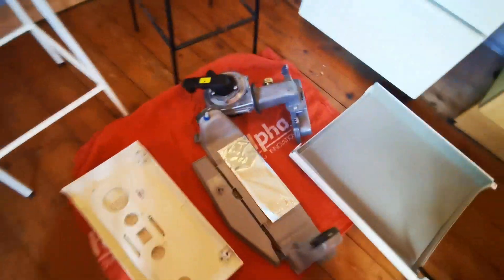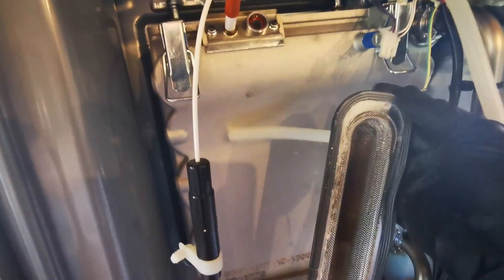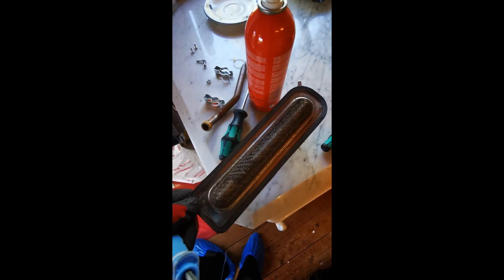Remove the earth tag on the burner. You can use this to assist you to remove the burner, as if it hasn't been serviced in a while it might get stuck down a bit. Check the seal, replace as necessary. Try not to touch the underside — the rough side — then remove and give that a clean out with a brush if necessary.